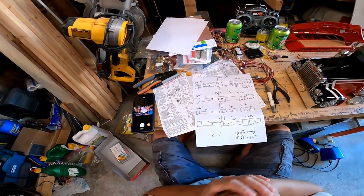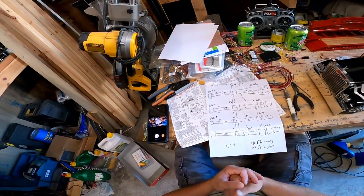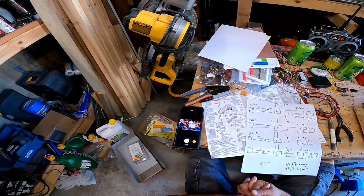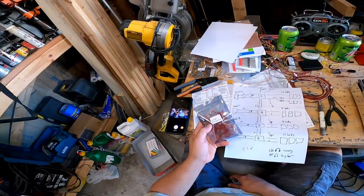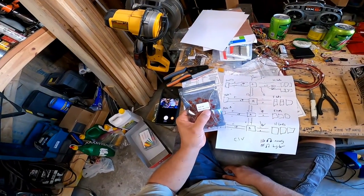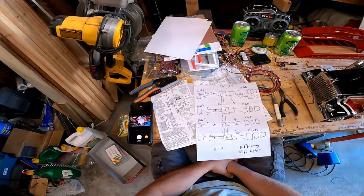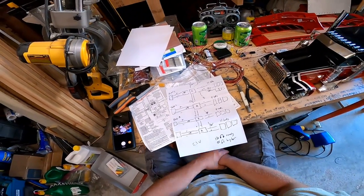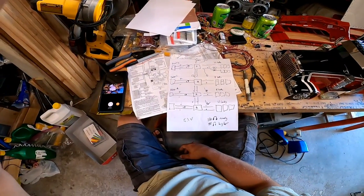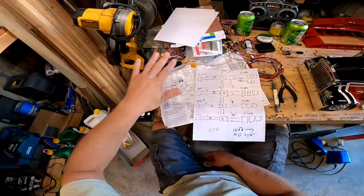Well, for that, I need to know about my LEDs. So we need to do that and figure out resistors. This is, again, where I'm mostly clueless. But all my LEDs, the red and the orange, seem to go off of 2 to 2.2 volts. So if I stack them in pairs, that gives me 4.4 volts maximum. And I'm going to be feeding them 5.1 volts. So I will need a resistor just to make them work.